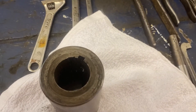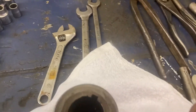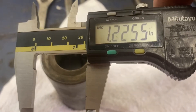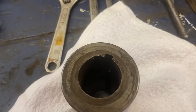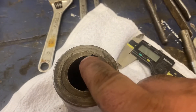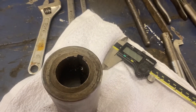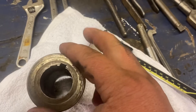So where we're at — roughly that. So we're not gonna take too much out of it. It'll probably take that slot out, hopefully. This is a slow spinning application. When you get on these bushings and you start boring them out and boring them out again, remember to think about your wall thickness.